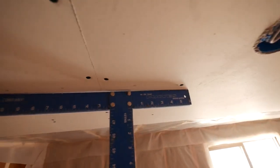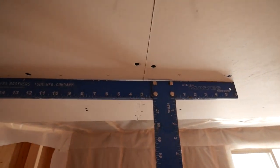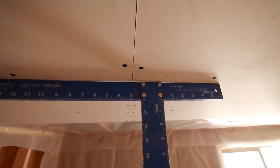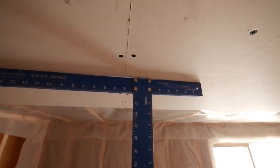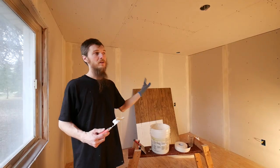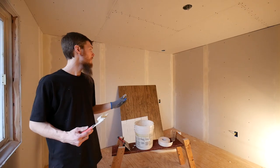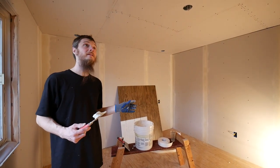The ceiling is going up pretty fast. I just got my second floating butt seam going. You see how that creates that little divot — that space right there? Perfect. We just finished up all the seams in the bedroom, and this is actually moving right along faster than I expected.